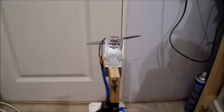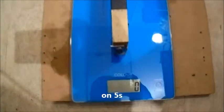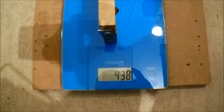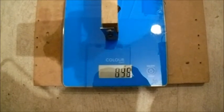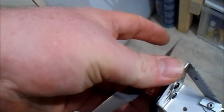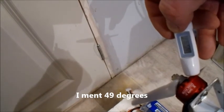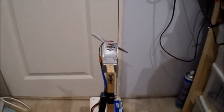I thought I'd give this one a try — this is an APC electric 5x5 prop on 5S. Let's see what happens here. A bit disappointing. Whoa — that's a bit much. 48 to 49 amps there. I think that's probably a bit too much. I'll call it quits on that one — that motor's had enough abuse.